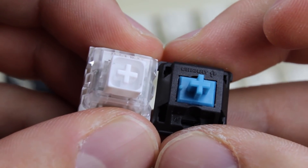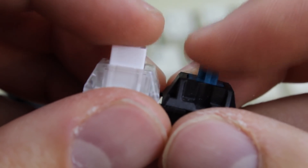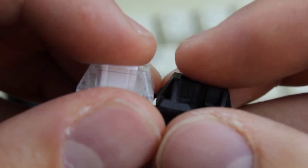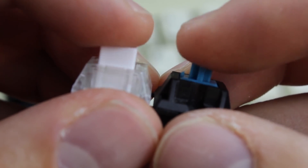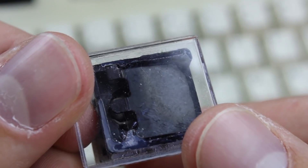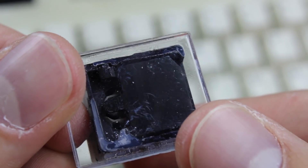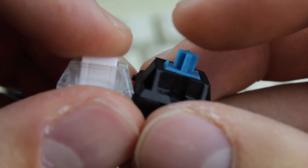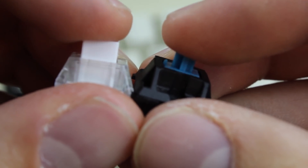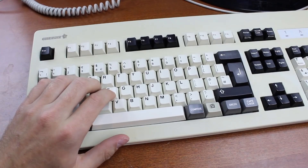Because in both cases the clicker is not the part that inherently causes actuation, neither click is perfectly aligned with the actuation. This is pretty normal for clicky switches — in fact, off the top of my head the only clicky switch still in production that does align them is buckling springs. However, actuation before rather than after a click is basically objectively worse, so that's a point against the Kaihua.